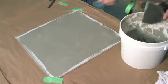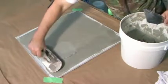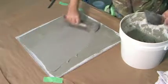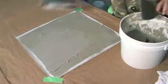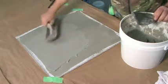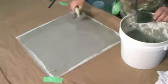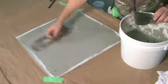When the first coat has fully dried, check for any raised granules or nibs which were left behind by the trowel and scrape these off before beginning your second coat. Apply the second coat in the same manner as the first coat, making sure again to fully cover the surface in a uniform manner.